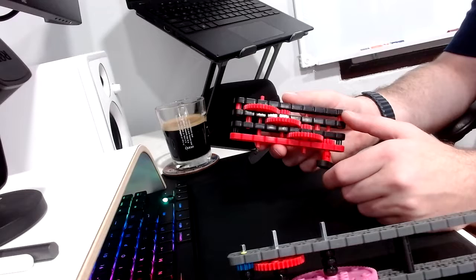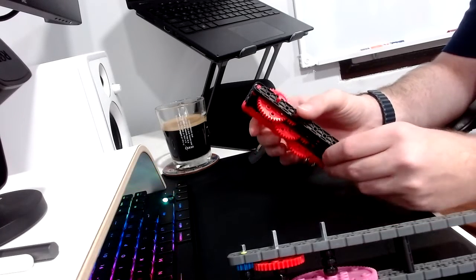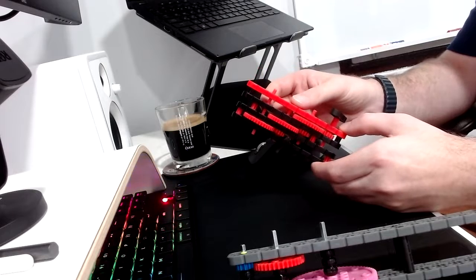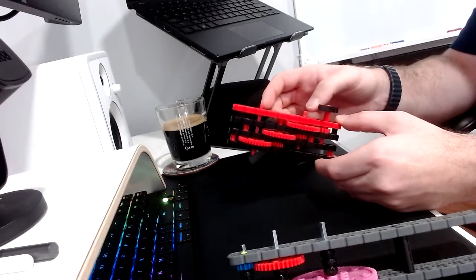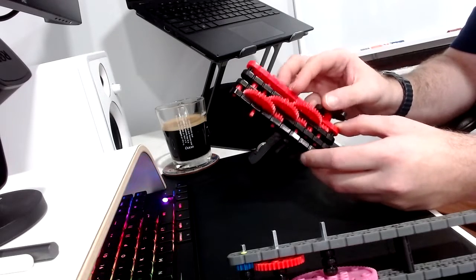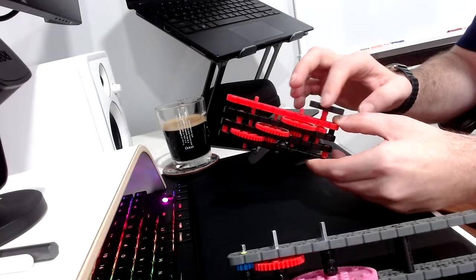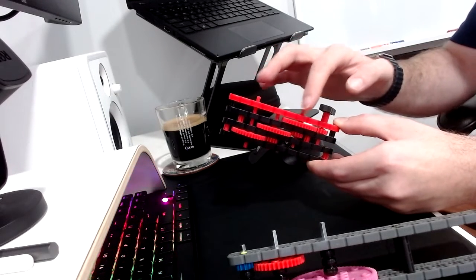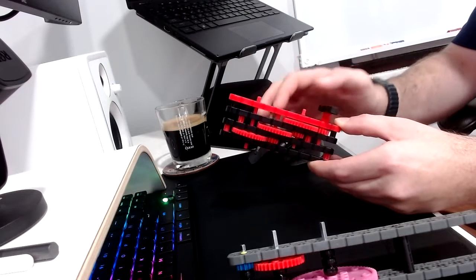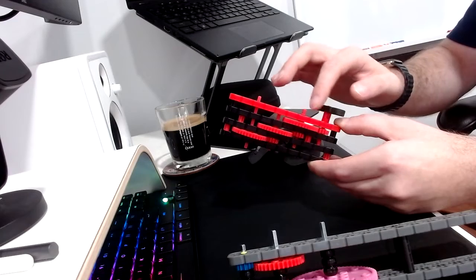To begin with today, if you're new to robotics or if you don't really understand gearing, I do recommend that you have a look at the tutorial on VEX IQ STEM Labs — specifically this one here with our small to big gear ratio. This is going to be my driver gear, and if I rotate this, you'll be able to see the other gears, which are all connected from this main driver gear, move very, very slowly due to the gear combination being used here.